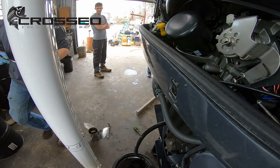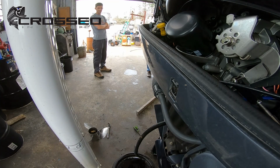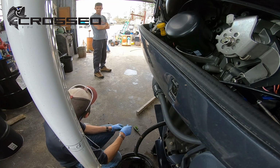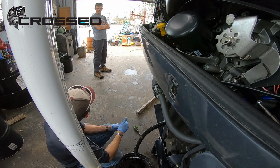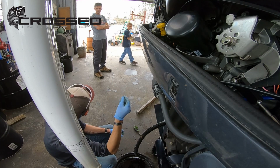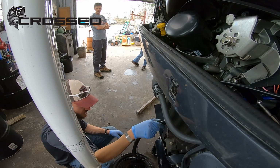Oh, good job. With 2 and 4 stroke in 2019 or 2020, whatever year, other than torque and all that, we're talking just break-in style stuff. The reason there's a 20 and 100 hour service interval and a break-in period on a 4 stroke is because after it's machined, since you're using the same oil over and over again, any filings left over from machining of the motor itself you're getting out. So that's why at 20 hours you change the gear lube and the oil. Yep, because those are parts that are constantly moving and there might be some residual shavings, and there's so much more in this block that you want to get it out before it causes any damage.